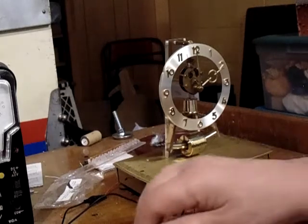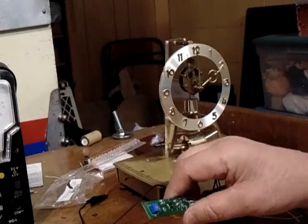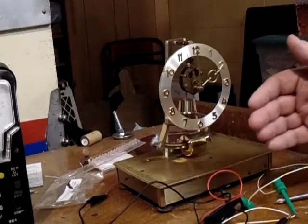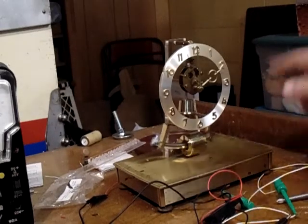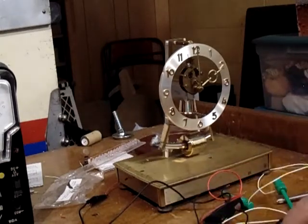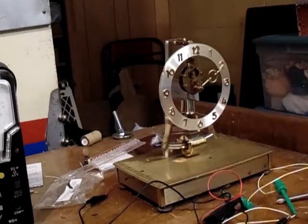The way I tell it's working, there's a little pull in there and it pushes the clock through. Now the adjustments are here — this little pot. This is a very coarse adjustment. Different clocks need a little extra push or a little less push. But if the clock goes really fast, cut down on the pulse width of this circuit. Or you move the bell up and down.